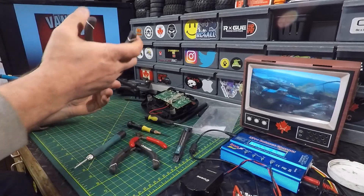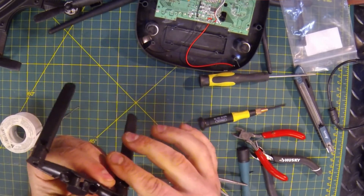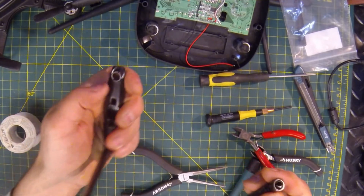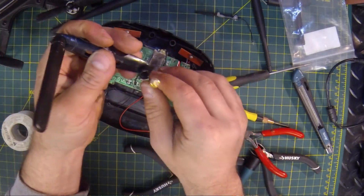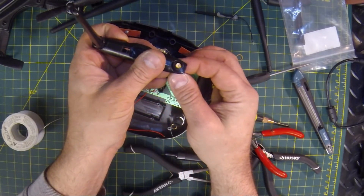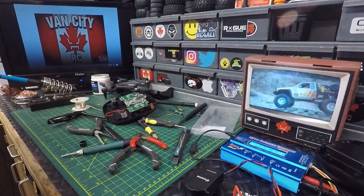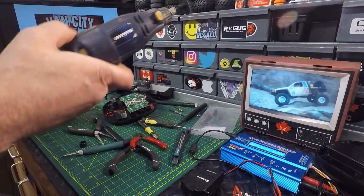Let me just see how this comes apart — looks like we're going to squeeze this. We'll cut it down a bit because we're going to need some room for that antenna connector. We'll cut it flush and may even have to make a little washer to hold it in there properly. I've already got the Dremel set up nearby with a zip blade — we'll just cut that flush now. Then I'm just going to clean out some of that plastic that's in the way.